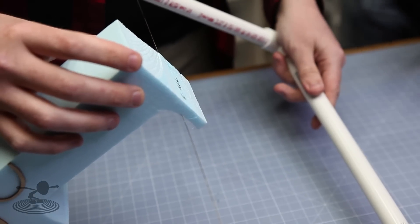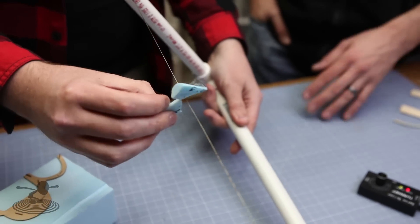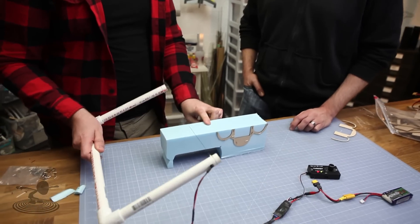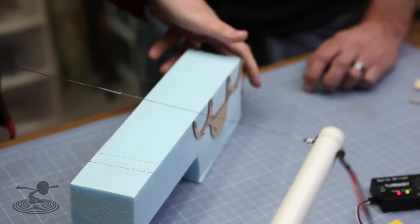This is normally around the speed I like to go. Now I see your wire is bowing — that's a big no-no when you're cutting around, right? Actually it doesn't matter that much if it's bowing, as long as you don't go too fast and you're riding between the two formers. You should never pull on it — it just makes things worse. When it starts bowing, slow down so it has time to catch up. When you have a bow like that and you wait, it stores a lot of energy, so when you touch it to the foam it's going to cut a lot straight off.